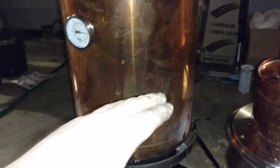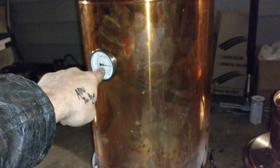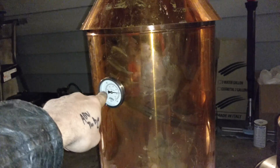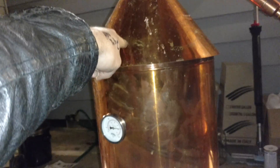Inside of this I only had it half filled to 5 gallons. I believe that the most important measurement is to know, right here, what that temperature is — the temperature of the vapor. But if this is filled to the top of the still, we will only know the temperature of the liquid and not the vapor that's up here.